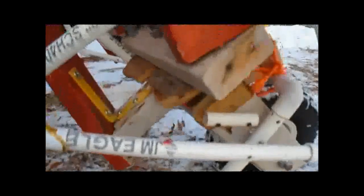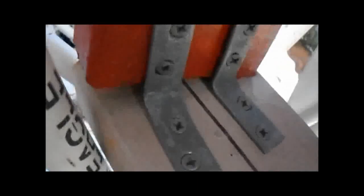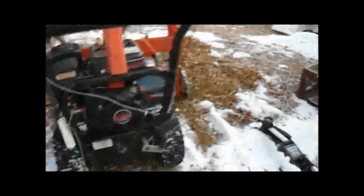I've also got to fix this sagging going on with the wheels, but that's probably just because I need a better 90-degree bracket, because this one's starting to bend out of shape just because of the sheer weight. Another issue I was having was the transmission was getting out of alignment, so when I was trying to make the mech go backwards, it wouldn't, probably because the cables are slipping in their mounting points.